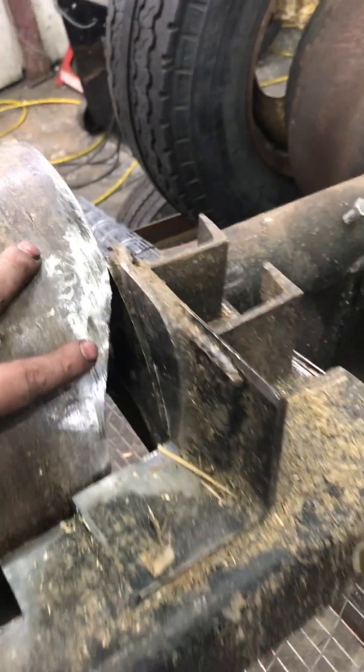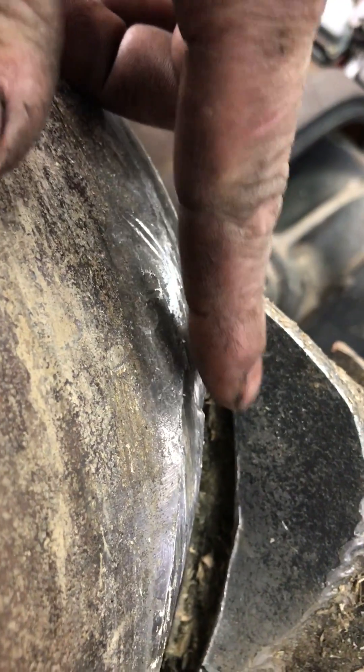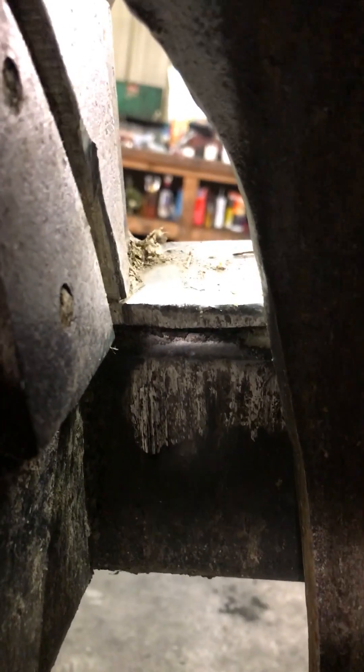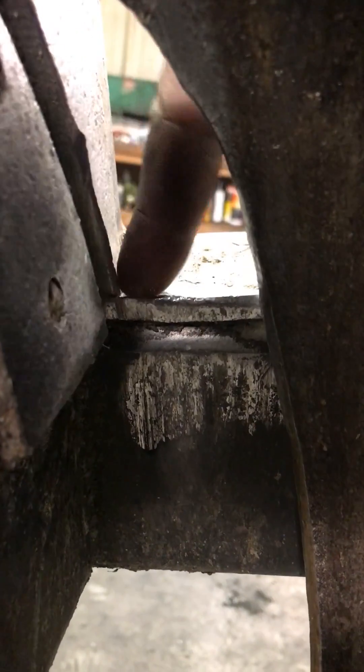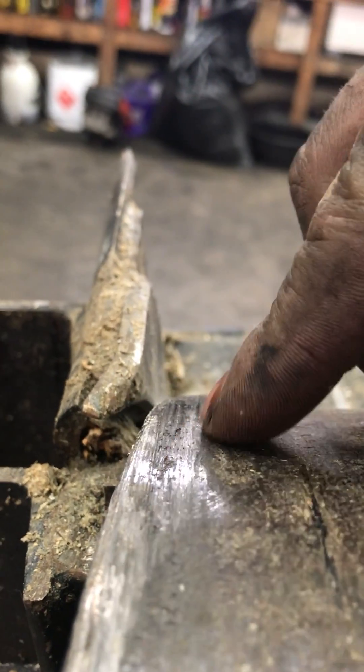The chunker's been running pretty good, still need to play around and finish getting it running on wood gas. This is what I was telling you guys about — you can see it's actually bending up and starting to ride on the groove pretty hard, rubbing on the anvil right here. As the cutter bends up and out it's just rubbing right here; it's not getting out of control but it is a little bit annoying.